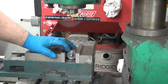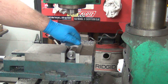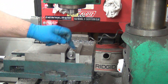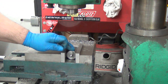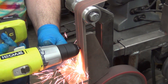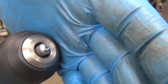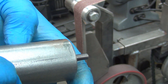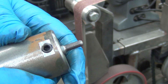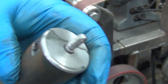I could grind this down a little bit and get that recessed - maybe for a little safety issue - grind down the other end so that the set screw sits flush. If I were to get my hand up against this while it was spinning in the lathe, I wouldn't have this sticking out. That's what I was talking about - getting it down there flush. Now we can see about mounting it up in the little lathe and finding out just how far that's off-center, if it's what we need.